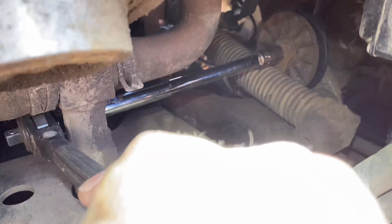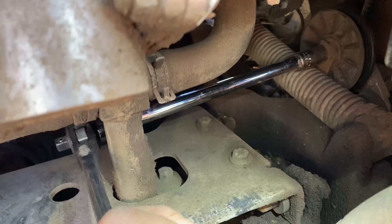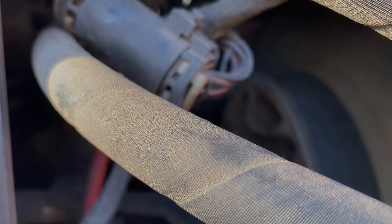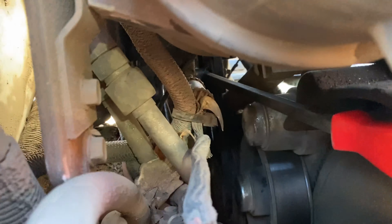So this is a lot of fun, but with an extension you can get a wrench on there and it loosens up pretty easy. A little tricky to see, but here's what I came up with: I had to take the pry bar and push the tension wheel forward, and put a wrench on it with the allen socket to hold it tight on this side. Then I have to go to the other side of the machine under the cab and tighten and loosen things up from there — this is the only way I can get this to work. But I was able to get the belt on.